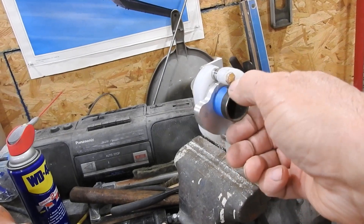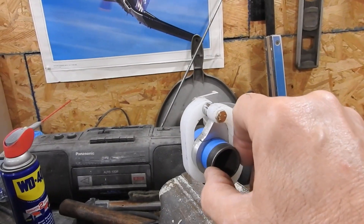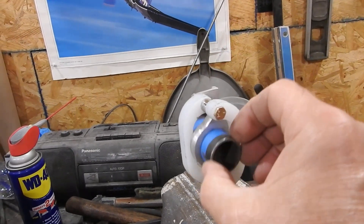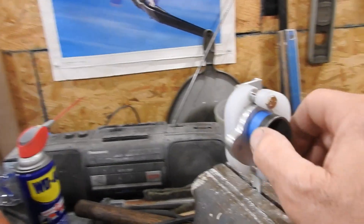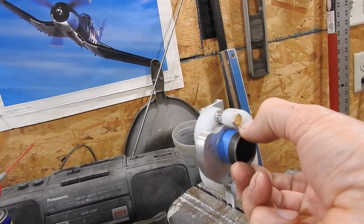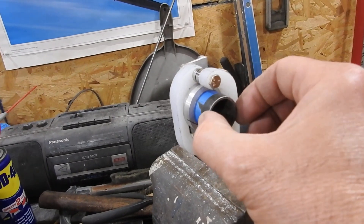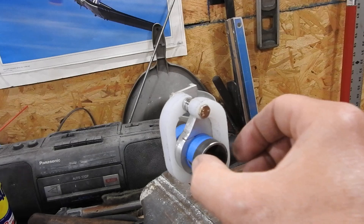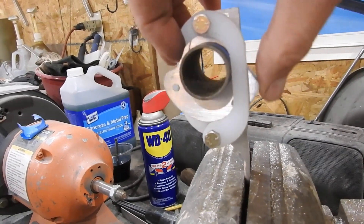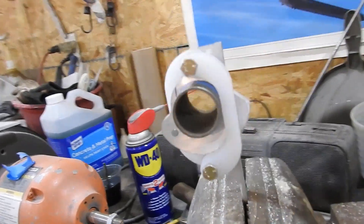The first 24 degrees — this is the full up position, doors are closed. So the first 24 degrees the doors drop open, as you can tell by this up and down motion here. And then it can travel the remaining 90 degrees. From this position it will turn 90 more degrees — that would be the full down position. So it just catches the point where it transitions in the last 24 degrees. You can see how that thing drops as it rotates — that's a half-inch of stroke. That's the general idea.